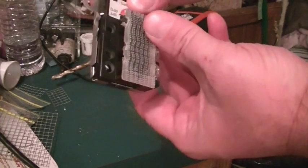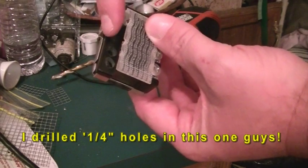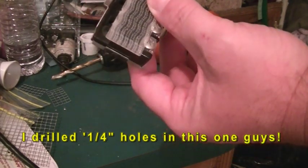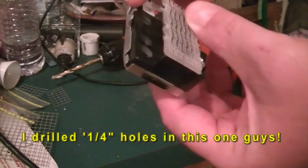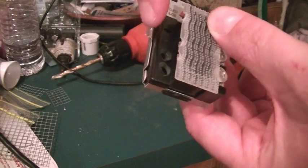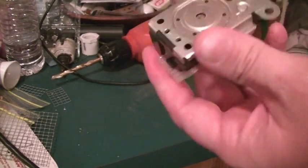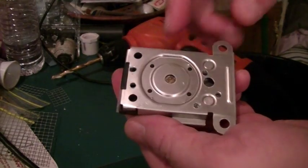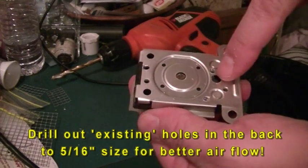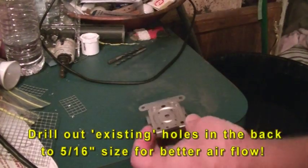See here where I've got my 3/16ths holes drilled. As a matter of fact, I think those may be, instead of 3/16ths, these are going to be quarter-inch size holes here. Those are going to be quarter-inch size, which is just 1/16th step up right here. And what we're going to do is we're going to widen out to 5/16ths these three vent holes that are already on here. We're going to widen them out to 5/16ths size.